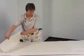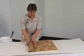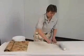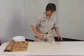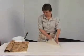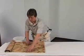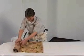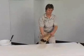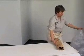After wetting or pasting the sheet, fold the paper in half and pull any remaining length up onto the table and repeat the pasting method. Fold the smaller length in half as well. You should have a long fold and a short fold. The top edge of the sheet should meet the bottom edge. Roll the sheet up loosely and place it in a plastic bag to relax, or book.